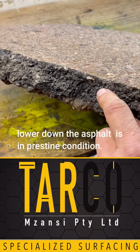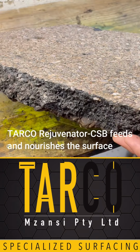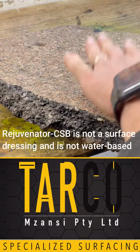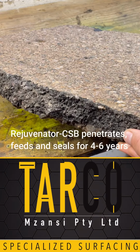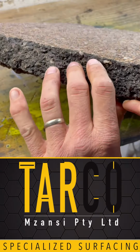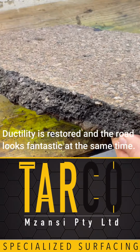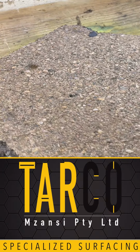So what the rejuvenator does is it penetrates into the surface and it feeds the existing bitumen in the road. It's not a surface dressing that we put on top of the damaged surface, because that would not give the flexibility back to the existing surface as it sits. So if we spray the rejuvenator, it penetrates and it seals the entire top surface, and it also feeds the asphaltenes, maltenes, paraffins in the existing road as it sits, which makes it flexible and ductile. For about 4 to 6 years, it will withstand the vehicle traffic again.